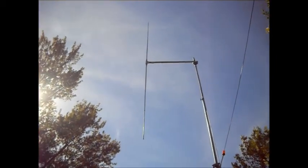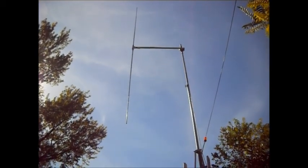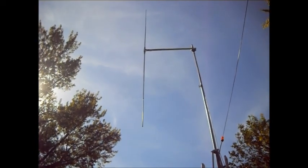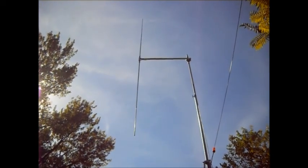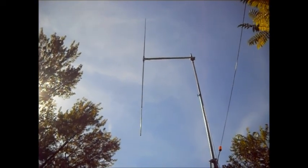That's what a dipole looks like, and all the close-up pictures. You could use copper pipe. I'm sure if you've got 3/4 water pipe, it's going to be close to 7/8. You could use the same plastic fittings I use. The piece going horizontal up there flat, that's a 1.5 inch piece of aluminum pipe. I just shimmed it up with plastic. You could do the same thing.